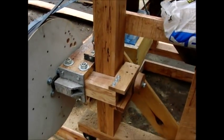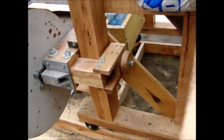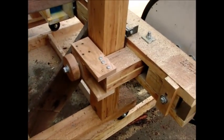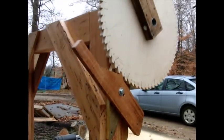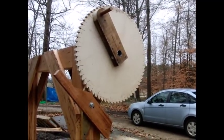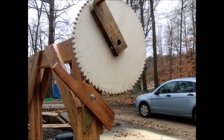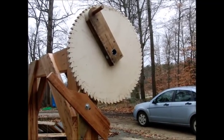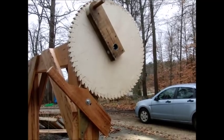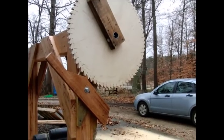When I'm adjusting up and down, there's a clamp. That big wheel there loosens a clamp to the main post — I've got one of those on both sides. Once I loosen those up, I can unlatch my catch and go around. Basically each little notch is one sixteenth of an inch on this wheel, so I can count up quarter inches and half inches. If I want to go up or down a sixteenth, I can do that fine of an adjustment.